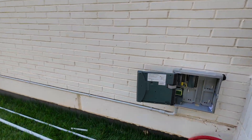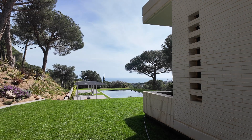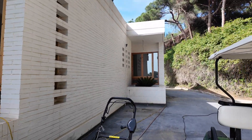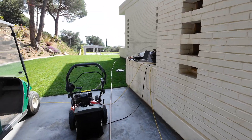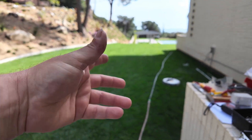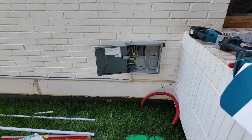I just dropped the box on a wall and connected the electric cable. This property is really close to the sea, so we have sometimes really heavy storms with a lot of lightning. We have lightning protection on the house. Maybe this one was already hit — it's red, so I have to replace this module. If you believe it or not, your entire irrigation system — because it has a lot of water in the ground, centralized in one point — it's actually like a collector for lightning catastrophe. If the lightning hits this pergola and finds its way into the irrigation tubes through the water — because water running in plastic tubes is of course a conductor — then the lightning will come through the tube and straight into your irrigation system controller.